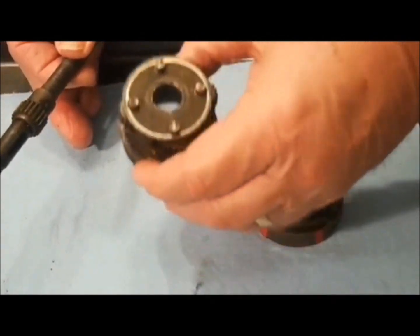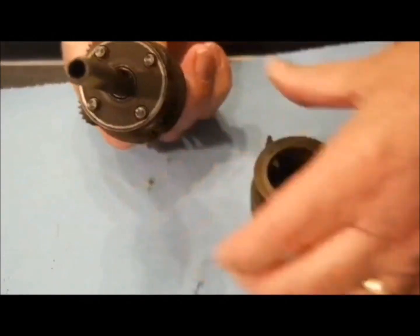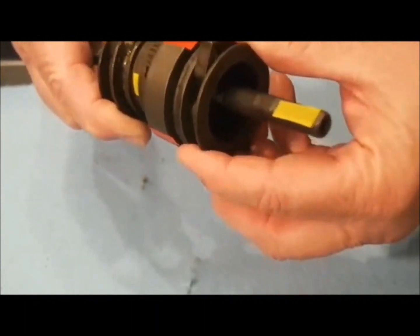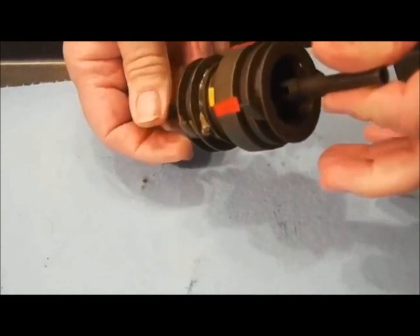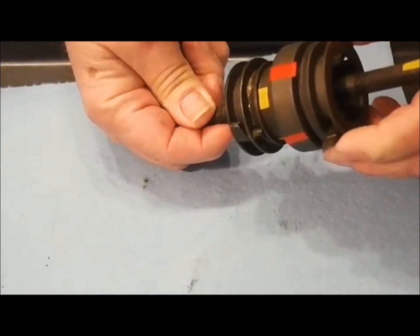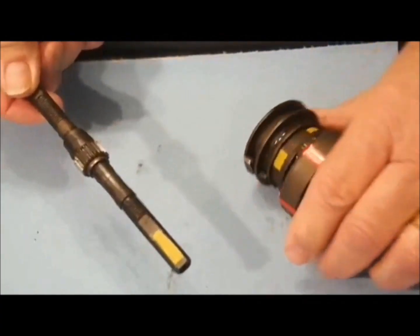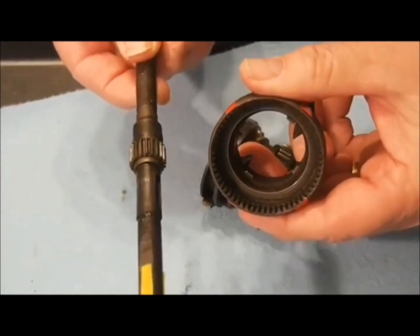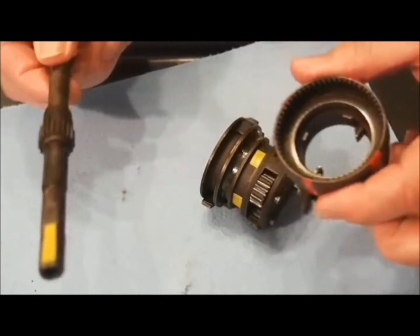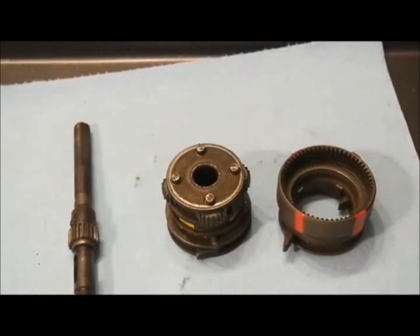The planetary drivetrain consists of a sun gear, a set of planetary gears which mesh with the sun gear and rotate around it mounted in a carrier, and a ring gear with gear teeth on the inner circumference which meshes with the planetary gears on the outer circle. To function, the power must be input through one of these elements, while one provides the drive output, while the third must be held fixed as a reactionary element. The difference in speed ratio is determined by the difference in size or tooth count between the sun and ring gears. The greater the size of the sun gear in relation to the ring gear, the greater the difference in speed will be between the input and output components. This is an important point to remember, as we will bring it up later as we discuss the function of the hub.